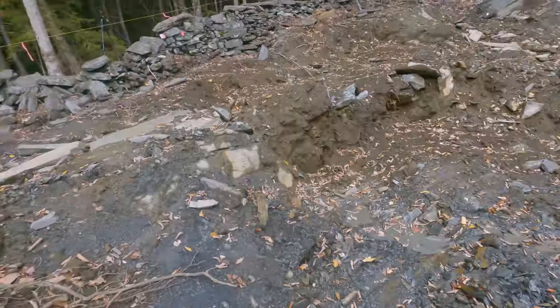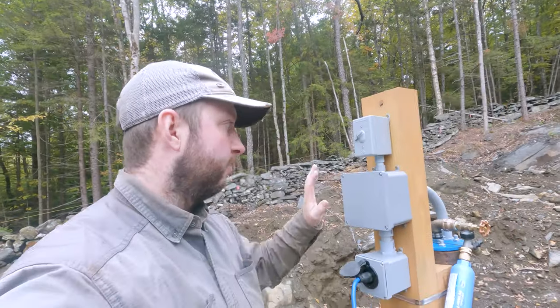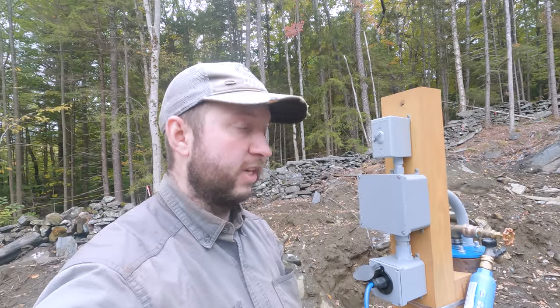So that way not only do we minimize the number of cycles on the well pump, but we also reduce the time the well pump is pumping against a closed system, just by opening the other valve. It has rained so much in the last week — the ground here is completely saturated anyway, so a little bit of extra water down here doesn't matter at all.